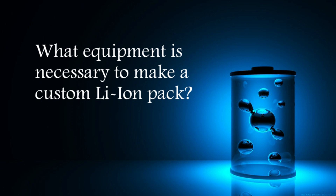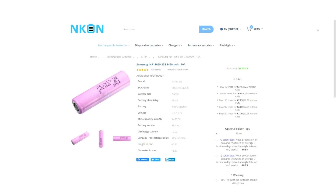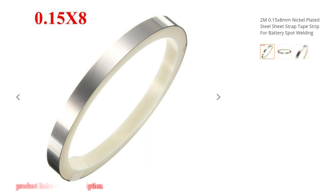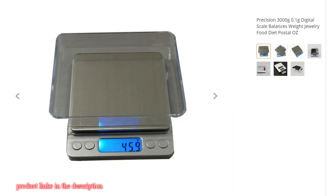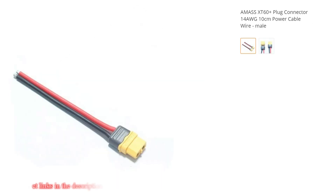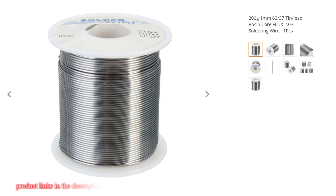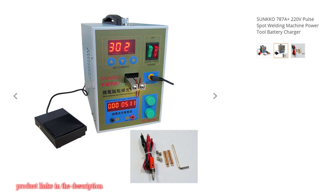Chapter 3. What will you need to actually make a Lithium-Ion pack? Well, of course you are going to need some batteries depending on your application. Stick around to the end of this video to figure out how many you will need. You will also need nickel ribbon metal strips to weld the packs together, some glue or hot glue, a kitchen scale, a balance cable, and an XT60 male plug with positive and negative cable — I would suggest 12, 14, or 16 AWG. You will need a soldering iron capable of reaching 400 degrees Celsius, some solder wire, and most importantly, a capable welding machine. Links for all of these are in the description.